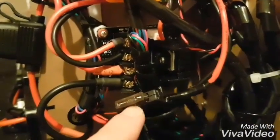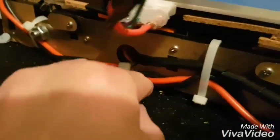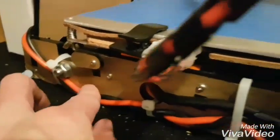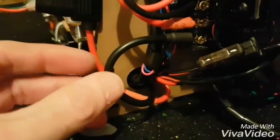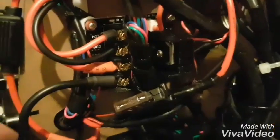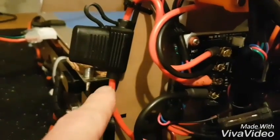Then I have run a separate 12 AWG cable. The reason I have twisted it is because that cuts down on electromagnetic interference, and there is quite a lot of current coming through here — if you turn these on with a radio you will see what I mean. The 12 AWG cable comes out of a separate positive and negative. I have also put a 30 amp power supply on it. The black wire goes into the negative on the MOSFET power input, and the positive rail does the same thing but via this 15 amp blade fuse.